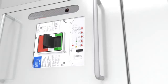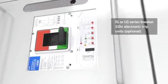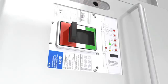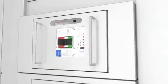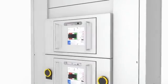The draw out cassette uses the JG or LG series breaker family. The standard offering of JG and LG breakers includes an adjustable thermomagnetic trip unit. Industry leading 310 plus electronic trip units are optional and feature curve shaping, zone interlocking, arc flash reduction, and diagnostic features.